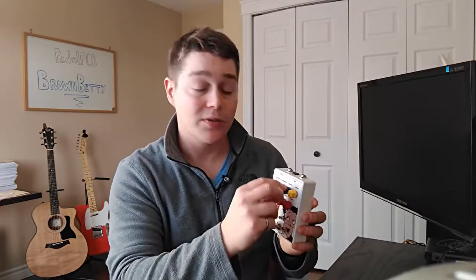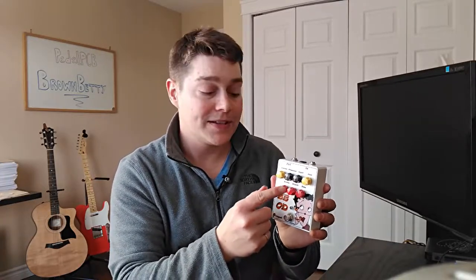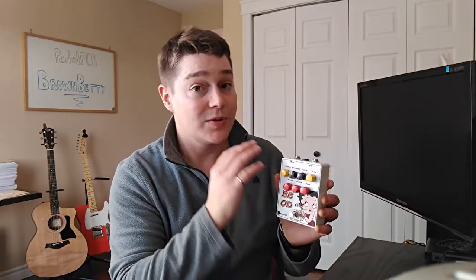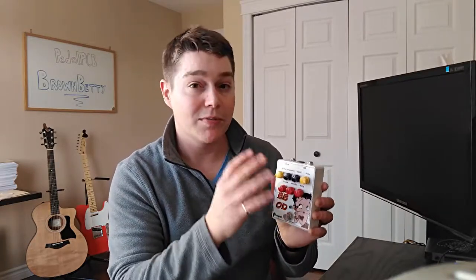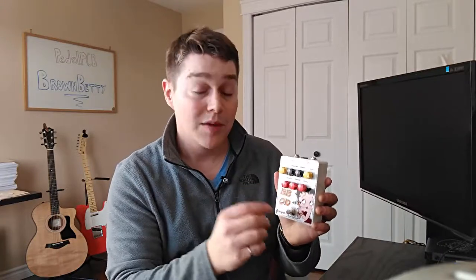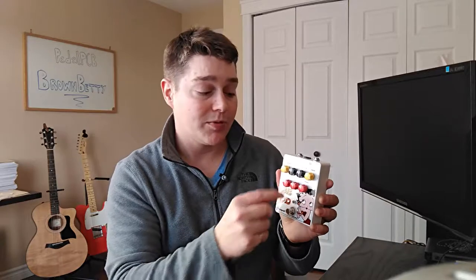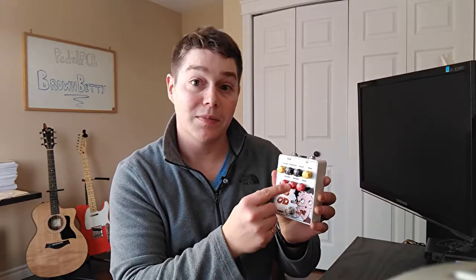That means they're just replacing a fixed resistance value with something that you can vary with a potentiometer. And then with the mid, it's actually just a mid boost tacked onto the end of the same circuit for the Dirty Shirley. So essentially, other than that tight switch, it's more or less the same circuit with maybe a couple different resistor values. But on the end of the Dirty Shirley, they add another op amp, which is providing more boost in the mid.